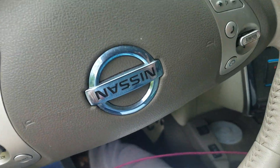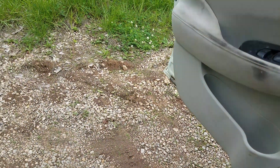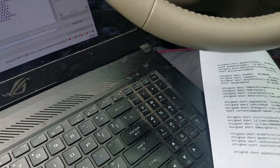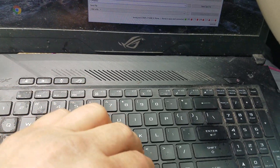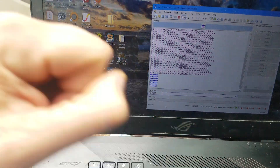So let's change modes — right now it's in throttle torque mode. You can see my little throttle going backwards if I wanted to go backwards. Now I'm going to put it in speed control mode. The command for that is control mode 13, so 13, 0, 0, 2. Okay, now it's in speed control mode.